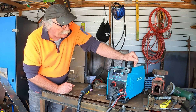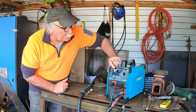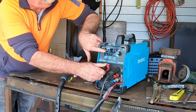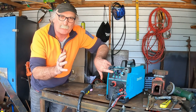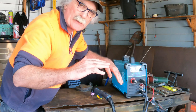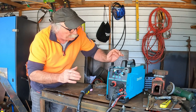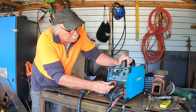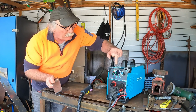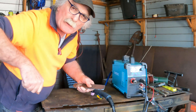Let's turn the beast on and I'll set my air pressure and then we'll be away. I'm running at about 62 to 65 PSI. The thicker I'm going to cut, the more pounds per square inch I use. So I like to start quite high, but I can always work my way down with the PSI. Let's start at say 66, 67, something like that. We're only starting cutting 5 millimetres, but I will also set that at 65 amps just to be sure I've got enough oomph.